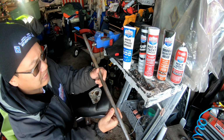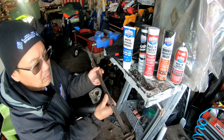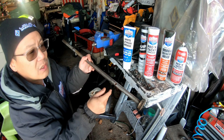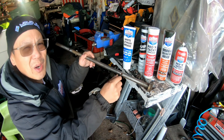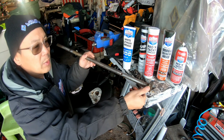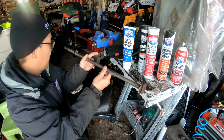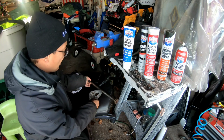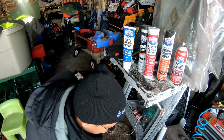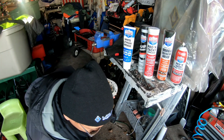The keyway is here right in the middle with the key in it already, right? And I was having a dickens of a time getting this gear off because these holes here are where the shear pins go in, right? And then over time, this kind of mushrooms out a little bit, so you weren't able to get this gear out. So I had to grind it smooth so that it comes out. So that shaft is ready to go. So here's the part of the sandwich, right? This is the coupler that goes onto the impeller shaft with the spline.